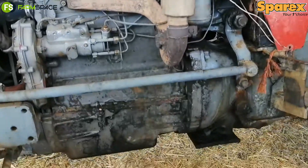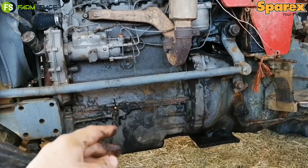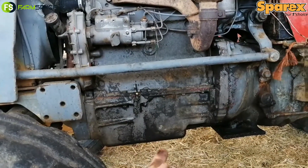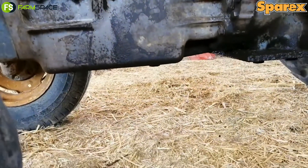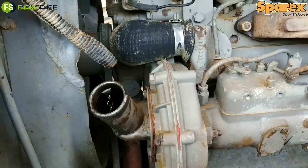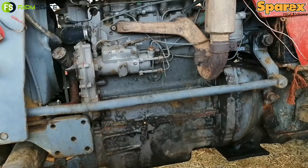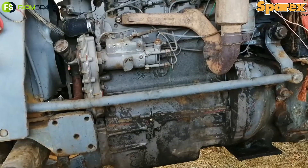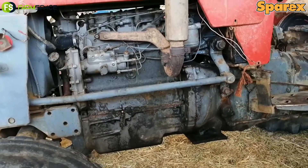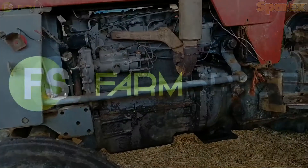At this stage all your engine oil has been drained out of your tractor. You have replaced your fuel filters and your engine oil filter located on the other side of the engine. Now you must put fresh oil back in. First, take the drain plug that you disconnected underneath and tighten it back down. At the front of the engine you can see where you put in the oil. Some engines use a 30 engine oil, some use a 15W-40 engine oil — just ask your dealer and they will give you the correct oil. A four-cylinder diesel engine like this uses more or less 10 liters of engine oil, so if you buy 15 liters that would be enough to service your engine.